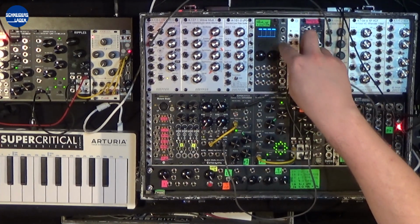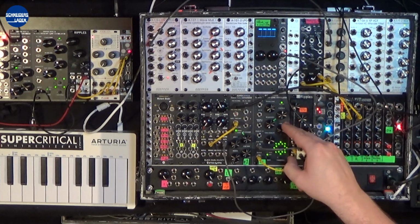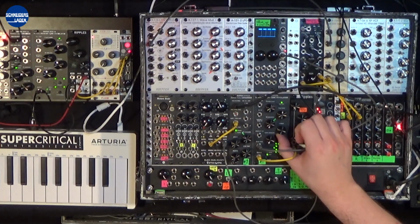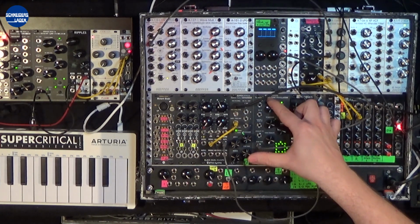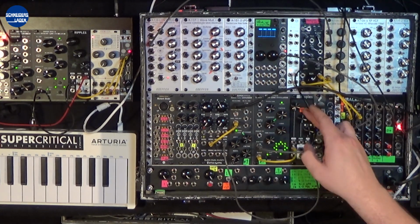But every time this pulse hits the module, it syncs up the phases of the voices, which are detuned after that. So there's not so much effect when everything is in strict tuning. Bear in mind, this is an analog device, but digitally we can know where the tuning is at. So this is the strict tuning. Phase, actually, and also the tuning of the voice. And when you increase the spread, you can get this flanging effect, all without an envelope. And this is without a filter. The filter is not doing anything here.